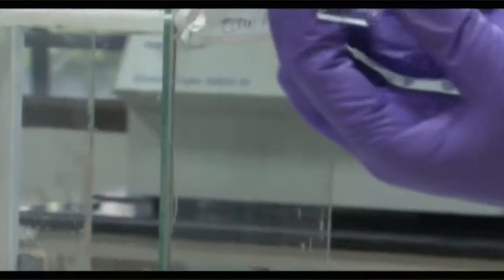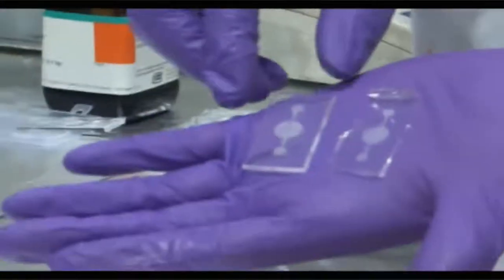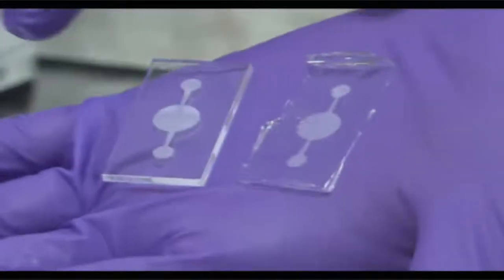Again reiterating, the PMMA surface which was laser machined earlier had a channel like depth in this particular shape and orientation, and the PDMS surface which has come out has the exact ridge like projected part of the surface coming out in those regions, as you can see here.